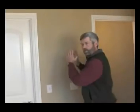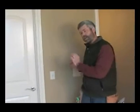Once you find one of those studs, they're normally on 16-inch centers down the wall, or they might be on 24-inch centers. If you happen to be living in an old house that's got plaster, you're probably going to have to mount that furring strip and do most of your nailing into that furring strip, and you may even want to have a little bit bigger furring strip so that you can take care of that. Well, we're just about ready to get started. We just need to go cut some furring strips, pop some chalk lines, and then we'll be ready to cut and install some crown.